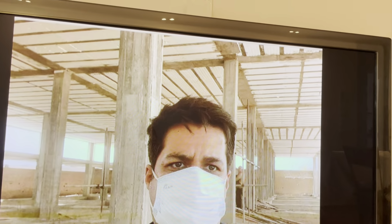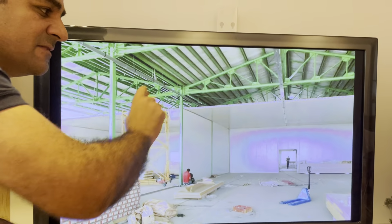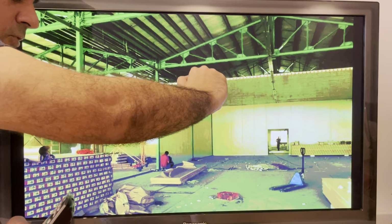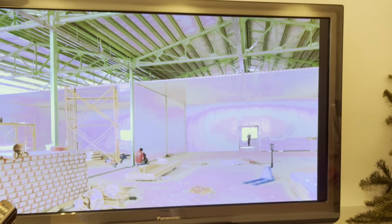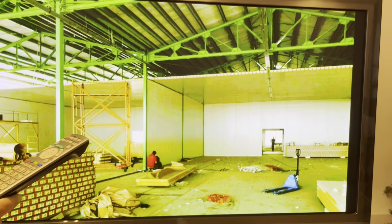Also in this system, for example, this warehouse, this building is very high, okay, with the false ceiling, second ceiling, another ceiling, we have constructed the suitable height of near 4 meters for better control of environmental factors. Exactly like this, you can clearly see in this very big environment, because the height is 6 or 7 meters. If, for example, without this ceiling, you cannot control the CO2, you cannot control temperature, you cannot control humidity, and we need the polyurethane panel. This is very strong insulation, and also because it's a huge environment, even with the strongest air handling unit, with the strongest chiller, with the strongest climate, we cannot control. The second ceiling helps us to better control environmental factors.